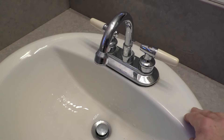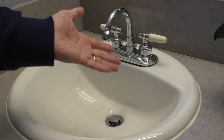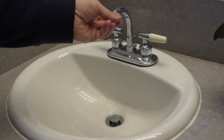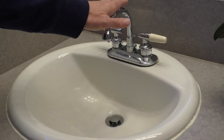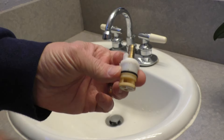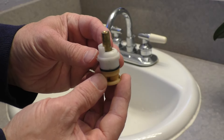We're going to fix that today. If you have an older style faucet, you may just need to replace some washers or seals — remove the handle, figure out what kind of seal you need, purchase it, and replace it. But for more modern bathroom sinks, you will probably need to replace the cartridge. This is what it generally looks like; it may look a little bit different in your sink.